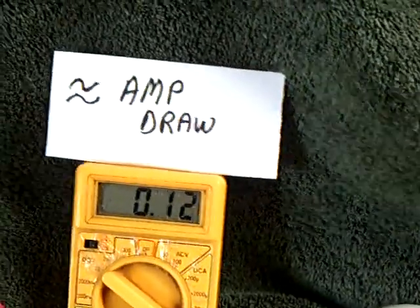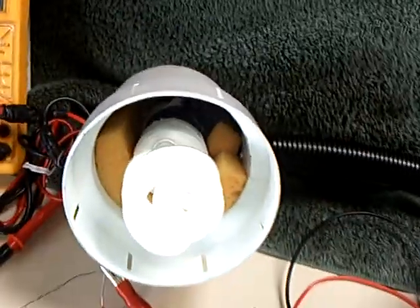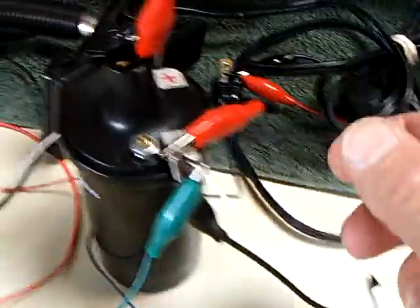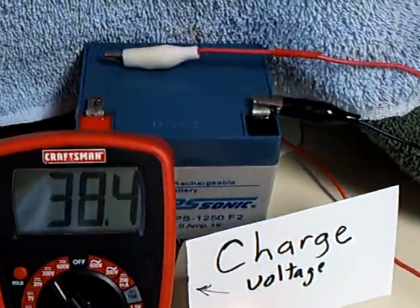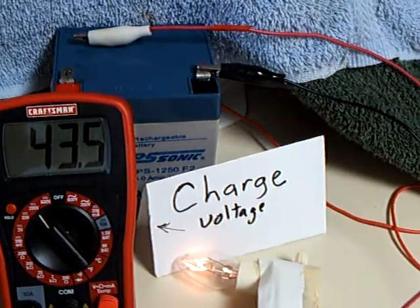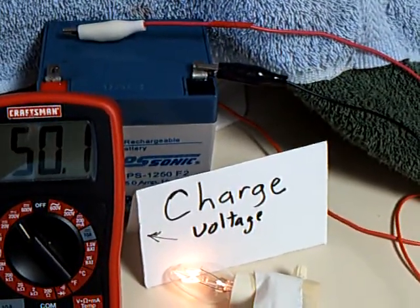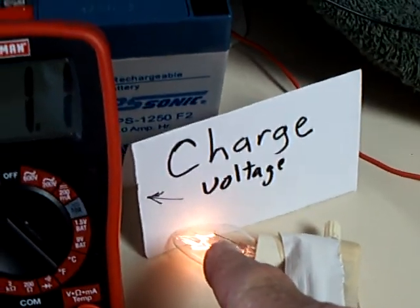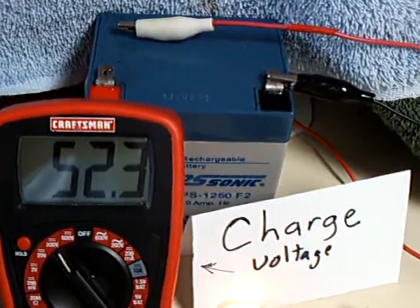Amp draw — I'm trying to keep this between 100 and 150 milliamps just to show what's going on. That's up to 50 volts. I'm going to turn this on again — there's the light. Now I'm going to disconnect the CFL ignition coil — this part right here. Watch the charge voltage on the cap when I do this. I can see the light getting brighter, but this just goes nuts. I haven't seen anything like this before. That's holding 50 volts on a capacitor under load — a 110 volt nightlight — holding 50 volts at a 200 milliamp draw. That's very impressive.